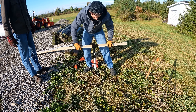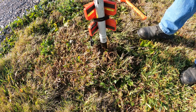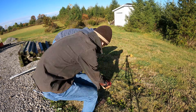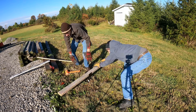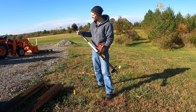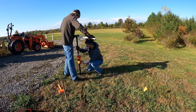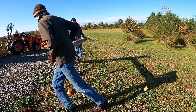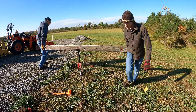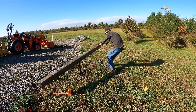I'll just use this like a T-bar so I can push down on it. It helps to push down a little bit as I go until the screw gets far enough in to start grabbing the soil. For the other end, because the ground slopes away, I went ahead and got the longer screw. I wish there was one a little bit in between these two — this might be a chore to shove into the ground. You can get whatever length you need; they even have extensions if you need to go really deep. Let's do the other corner, then I can run a string and put the middle two right in line with them.